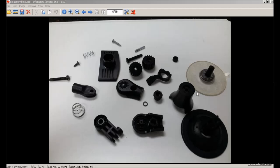So this pin will be attached to this slot here. I don't want to explain more about the detail of it. Inshallah in our next video session when we assemble it, maybe I can show you how the function of this part works. This component behaves as a tightener, where it can push the suction cup downward toward the surface, so it will create a vacuum and stick on the glass surface.